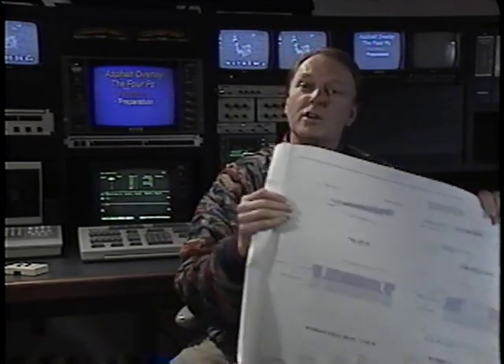There are also lots of details relating to utilities. Where no milling will be done, the level of each manhole has to be raised with a collar to meet the new higher pavement surface. Also, the engineer will check construction drawings and other records to be sure all catch basins, water valves, gas valves, and other utilities remain undisturbed during the overlay operation.